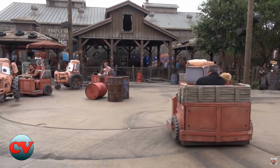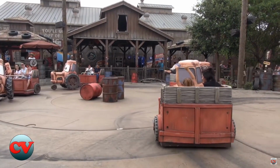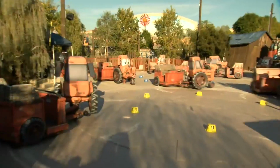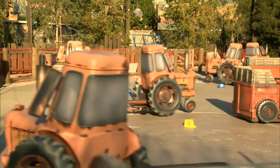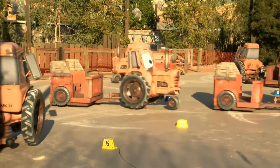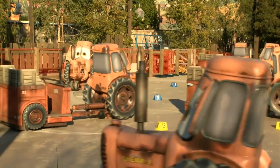As you can see, the mechanics of the ride are quite complex and can potentially be dangerous for guests, so on top of this is the concealment layer. To make loading faster and safer for guests, four stationary circular plates are placed at the center of the turntables, supported in the center. Wide flat ring-shaped platforms are then supported by and rotate with the spoke arms.